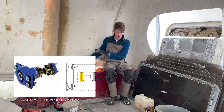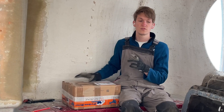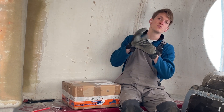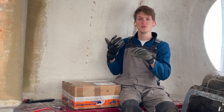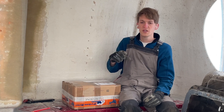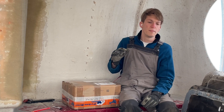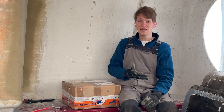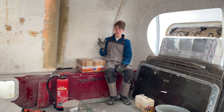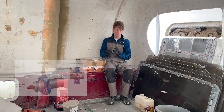That's a homokinetic coupling and it basically does two things. First of all, it prevents the prop shaft from pushing into and pulling out of the gearbox when you cruise forward or reverse. Marine gearboxes are usually made for this type of pressure, but since I'm using motors from the Nissan Leaf, the Nissan Leaf has never heard of such a thing. So I need to have an actual load bearing that prevents the prop shaft from pushing in and pulling out. That's the first thing.